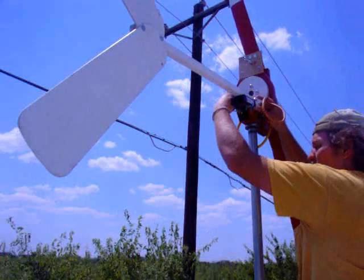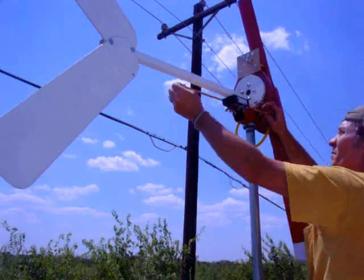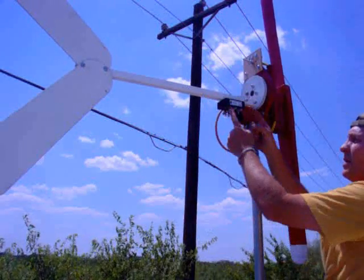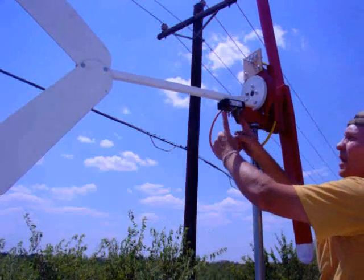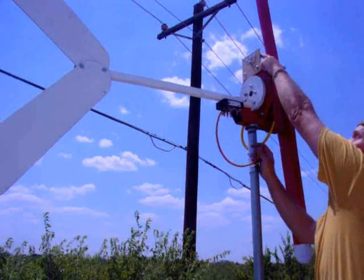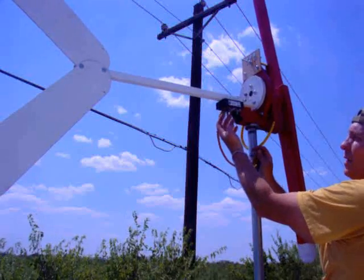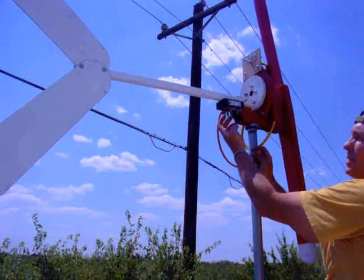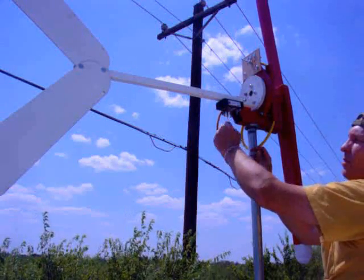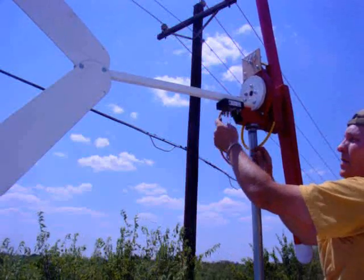There we go — keeps the wire up and out of the way of the stator. All I've got left to do is strip these and connect them to these. I put two screws up into the tail here. All three wires come from the stator up here, down this tube, around, back through the bottom, and they connect here. I soldered these — I tinned the wires, bent the wires, shoved them through, pinched them shut, and then re-soldered them. These things are going nowhere.